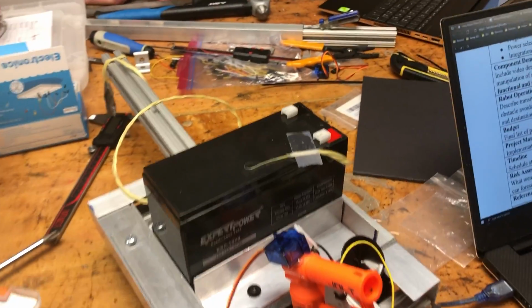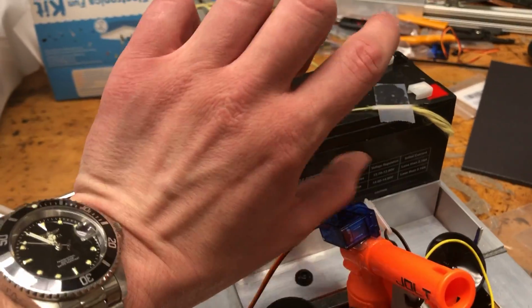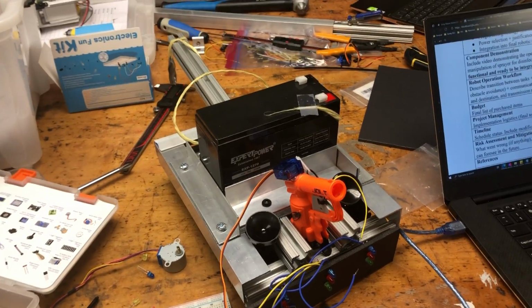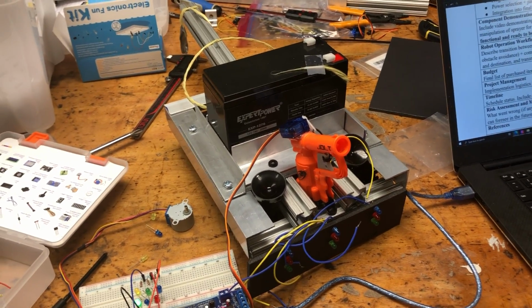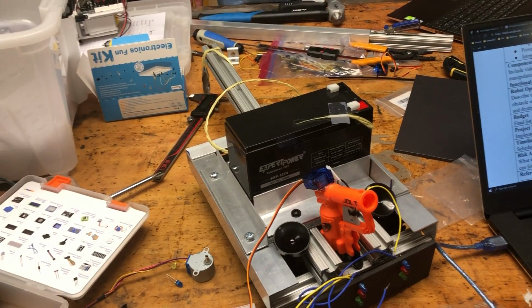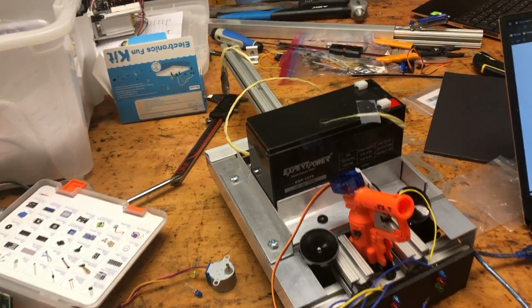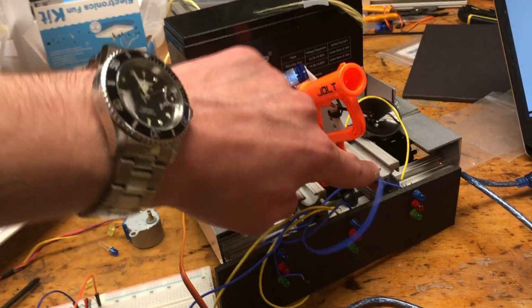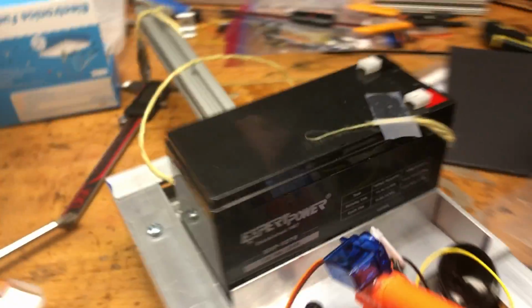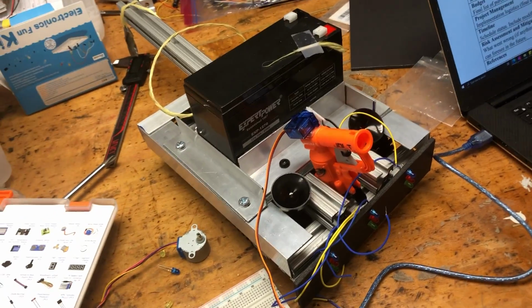And the Pixy, I guess we didn't mention this, but the Pixy's going to be mounted right here above everything so it can see in front. And we are also going to have 3 ultrasonic sensors, which we have also not mounted, but those are also pretty simple to mount. Probably just hot glue those or fasten them onto some foam. And I believe we're probably going to have an ultrasonic sensor right here on the front, maybe somewhere next to these lights, and one here on the right side, one here on the left side. So that's how we're going to navigate autonomously.